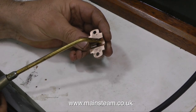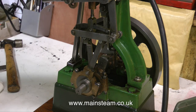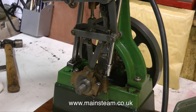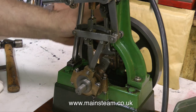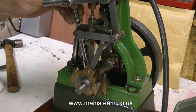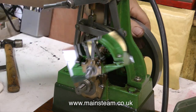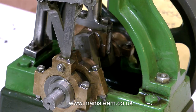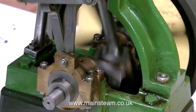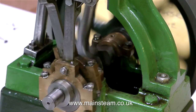After thoroughly cleaning and then oiling the main bearing, it's time to refit it to the engine, making sure to fit it the right way around. It's very important not to over-tighten parts like this — there's a good chance you will distort them. This bearing top cap is made of gun metal, which is quite a soft metal, not like cast iron. Having given the bearing top cap some attention, you can hear how much smoother the engine is. I've been requested to shut up and let you hear the engine running. So thanks for watching, and I hope you found it useful.